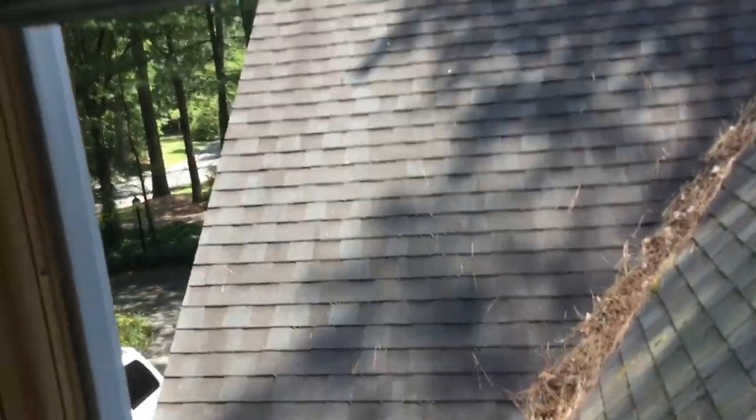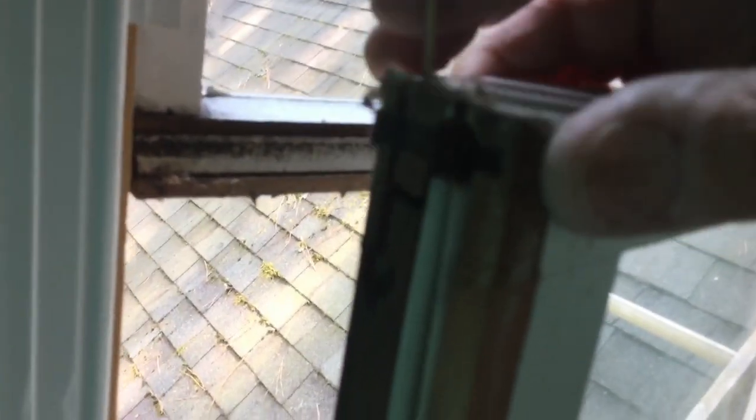So then I'm going to pull the sashes back down. Get it down. You can pull it in. It's got this string holding it down. And on the inside, it's got this. You'll see with the string attached. You really can't get a good picture of it, but there's a little piece of plastic that holds that string in. You want to pull that out and slowly let it up inside. You do the same for the other side, you do the same for the top sash, and the sashes will pop out. It's pretty straightforward to pull that string out of there.